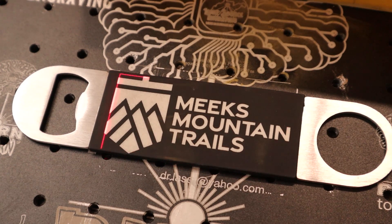Just like that we have the black completed. If you're not happy with it you can always run additional passes — you can run another pass and it might brighten it up. Sometimes it depends on the silicone, the lens you're running, and your laser. You might need three passes or you might need to adjust the power. This is run at Q-pulse 200 and frequency 100, so even non-MOPA lasers will be able to do this with no problem.